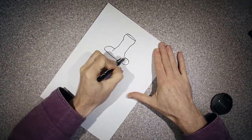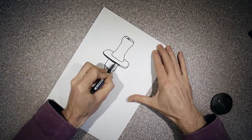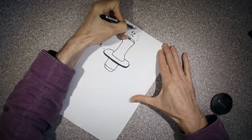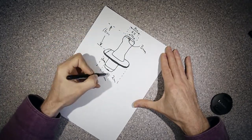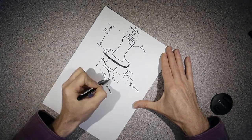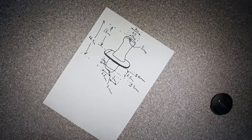This is a hole where our new nipple is going to fit, and I'm roughly measuring the size of it — it's still coming out at six and a half millimetres, which is the drill bit I used. I usually like to sketch a part on a good old-fashioned piece of paper and pen before going into CAD. This can quite often save you a lot of time in CAD, because you might go down a road and suddenly realize you hadn't really thought something through. So I get all the major dimensions in, which makes life much easier when moving into CAD.